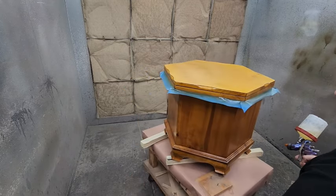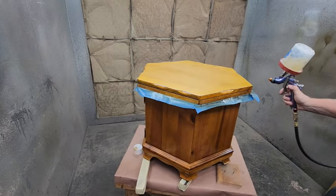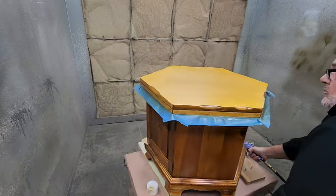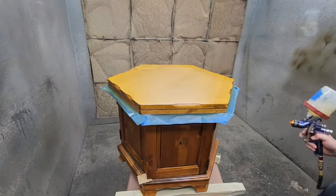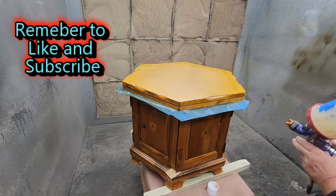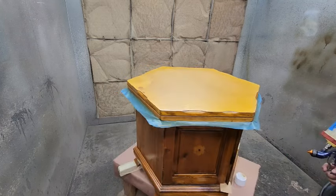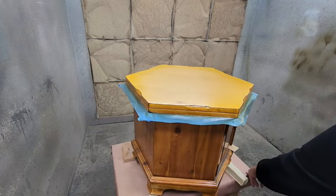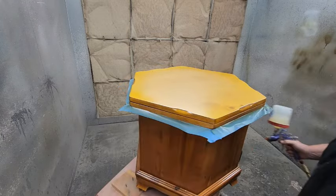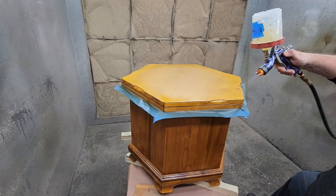The key is that if it's not going in the wrong direction, it must be going in the right direction — if nothing's jumping out at me as too heavy with a certain color, I'm pretty confident. I'll keep working that color and reducing the amount I put on each time, creeping up on the color I need. The clear coat will let me see the winterset pine as it blends in, and it also lets the light move differently through the different layers of toner.